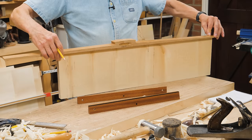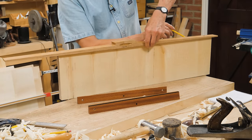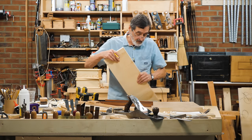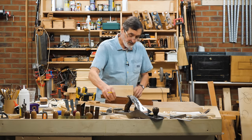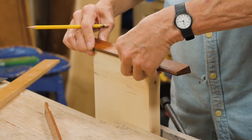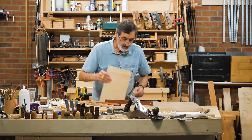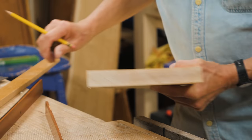So I'm going from the one-eighth mark at this end to zero at the other end. Now I'll show you in a second what we've got, because we've solved two problems with this. What we've solved is the straightness of the board, we've solved the twist. We're also taking out the lack of straightness as well. So I'm going to put a straight edge from this one-eighth mark to zero on the opposite side. Now this has got a hollow in it this way as well — we've got a hollow in the board as well. So that's an added fault.